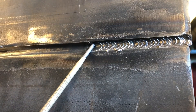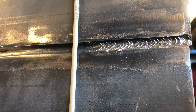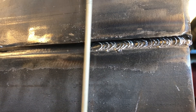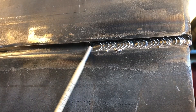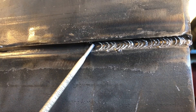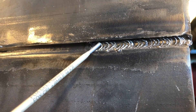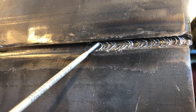I've got my first stop with 6010. These vertical lines are my four-inch centers. I'm going to remove this coupon — this is going to be my bend test, so this is within my bend zone. What we've got here is a crater and a freeze line left by my last pass.